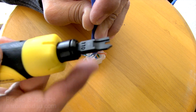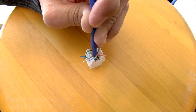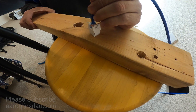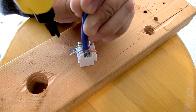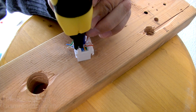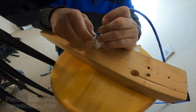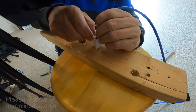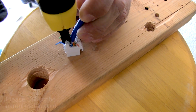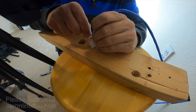There is a cutting edge and a smashing edge on the punch down tool. Don't do this on a surface you don't want to damage — I've had it flip and stab surfaces before. Take your punch down tool, put it on the edge, push it in, and click. Make sure the wire is nice and seated before punching, otherwise you'll end up tweaking it out.